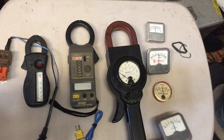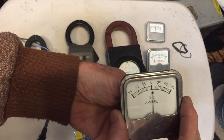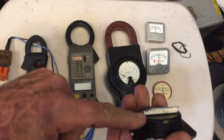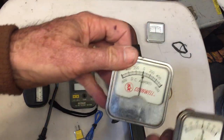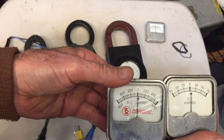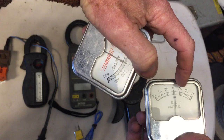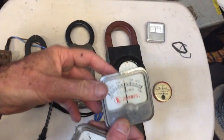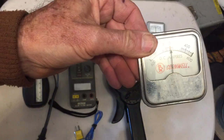I've had these DC amp meters for years. These are also inductive — they move by the magnetic field going through the wire, and you don't actually make electrical contact with the wire. It's just got a little channel here where you lay your wire inside. These are designed primarily for automotive use, although they could be used for anything DC. The scale on this one goes from 25 amps up to 75, and this one goes all the way to 600. So you're going to have a hard time measuring real small currents running through circuits with something like this.